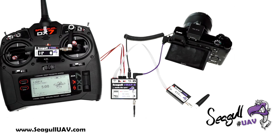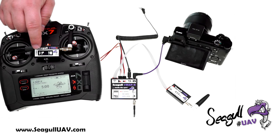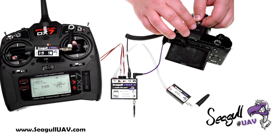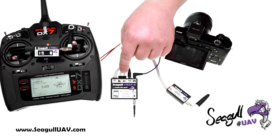Let's say you are flying a mission and photos are happily triggering, but then your camera dies — battery failure or something worse. To simulate what happens with our feedback on the TRX, we disconnect the sync feedback cable. We now see a warning that we didn't get feedback, and the failed photo count starts increasing every time the camera triggers. Plugging the sync cable back in, the confirmed count takes over again, because we are now getting feedback to our MAP-X module.